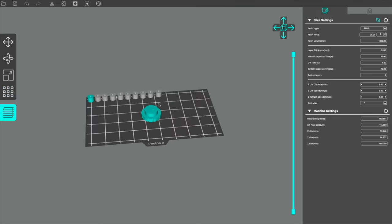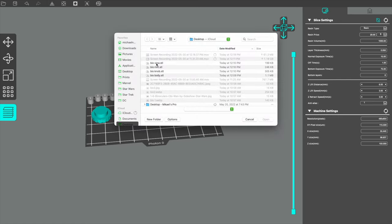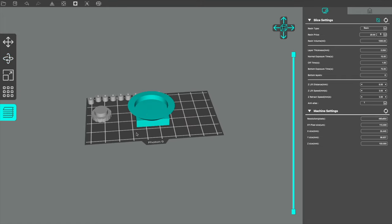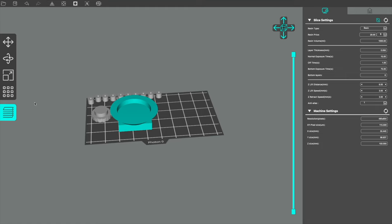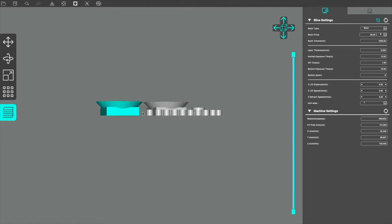The resin printed first go. I didn't have any issues with any of the rivets. If you're doing rivets — something small like that — always print out more than you need just in case you drop one or lose one, or some of them just don't print out. Especially when you're trying to get them off the bed, sometimes they'll break, and then you have to reprint the whole go again. It's going to take another hour to print, so it's just better to print a lot more than you need.